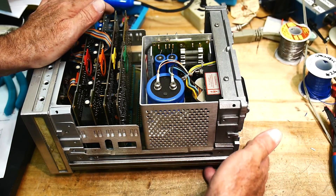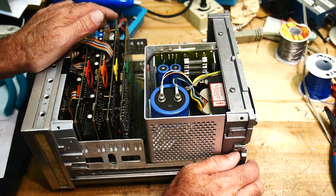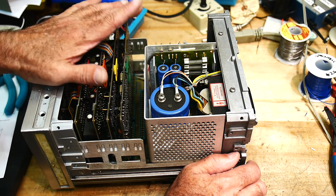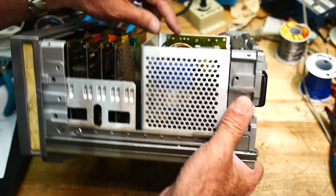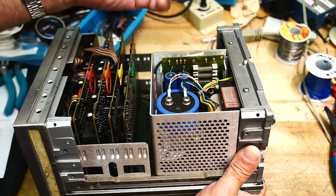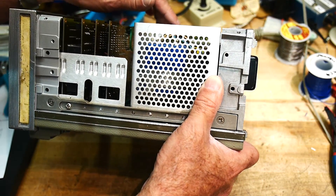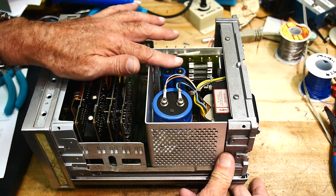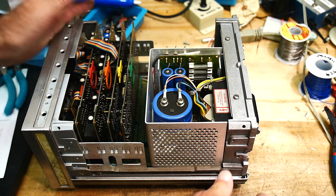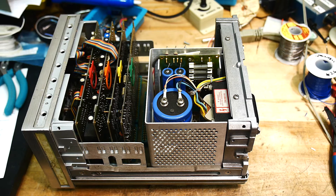In complete HP style, it's way over-engineered — three fuses on the inside and one fuse on the outside. This thing is way over-engineered. This is a perfect donor chassis, absolutely perfect. Written on the PC board are gold HP test points: minus 21, plus 8, plus 21, plus 15, and minus 15. It's got perfect supplies in it. And it does say 'bad' on it, so let's hope it's not the power supply — let's hope it's something else and the power supply still works.